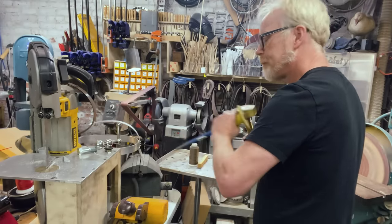There is a thing I wanted to show you, and I've got some reference material here. One piece of reference I have, some of the dings aren't accurate, some of them are, but I've got a dent here on the backside. It's right about here. So this is a urethane resin plastic, and as such, it's what you call a thermoset resin. You mix the two parts together, they create an exothermic reaction, they create heat, that heat changes the chemical composition of the resin and it hardens, boop, and you get plastic.